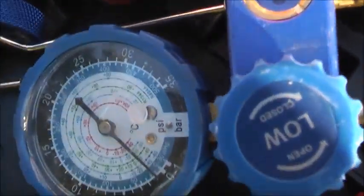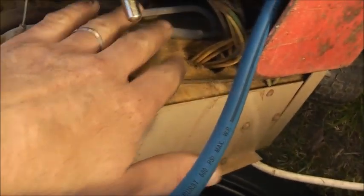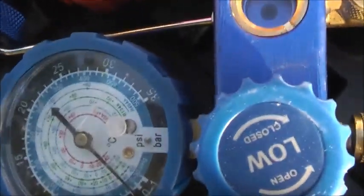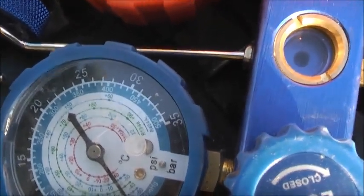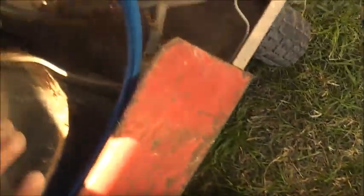Anyway. Might be my capillary too. It seems right, and the pressure seems right. I reckon this capillary might have to be a bit smaller with R152a. The capillary might be too big for this gas. Not as dense as R22. I know R22 is a really dense gas. So obviously now I know R152a is less dense than that. I think it's right. Steady it up now on the pressures.